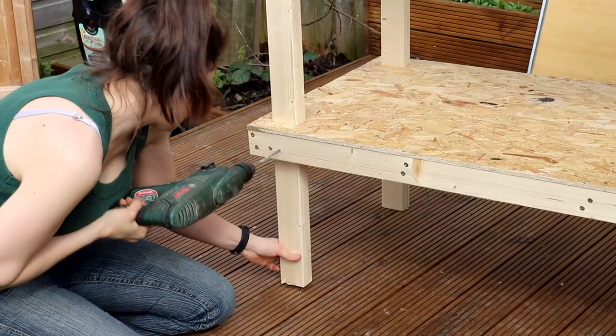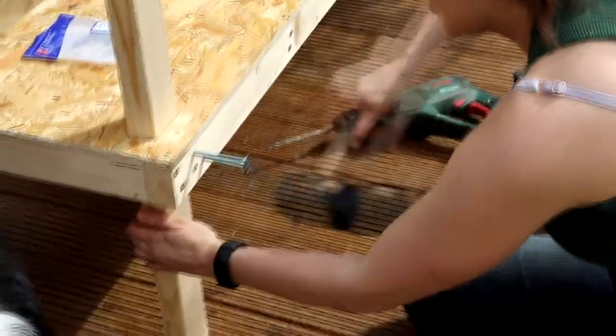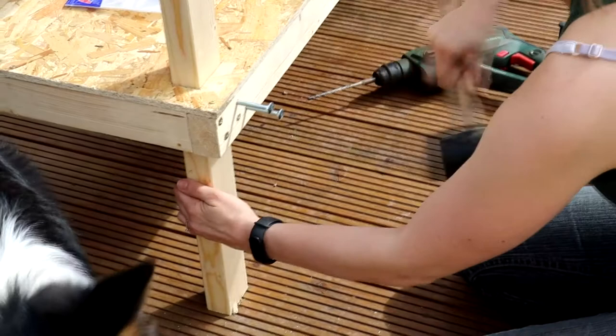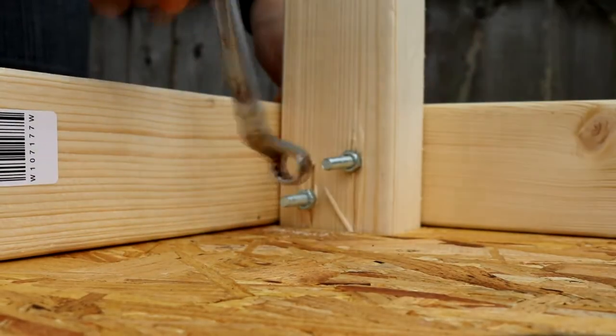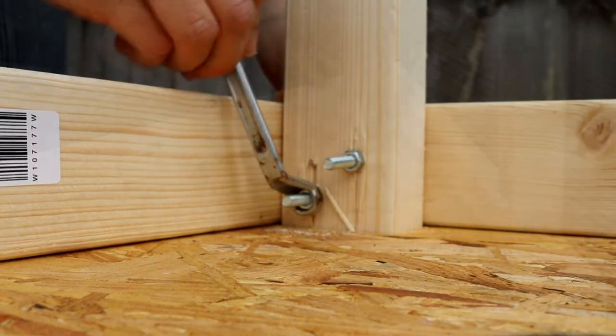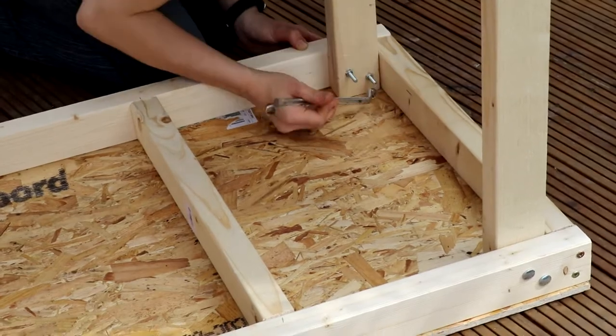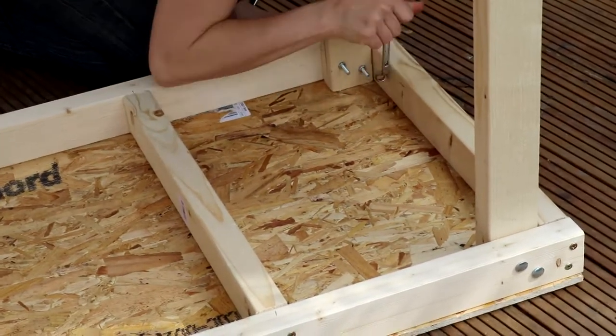This is the long drill bit I was telling you about. I knew I couldn't use a short drill for this, so I drilled straight through the two pieces and went all the way around, malleting in two carriage bolts per lower leg. Then the final bit was to tighten the nuts with a spanner, and that was it. I do regret not using washers as well, because sometimes the nuts partially went into the wood — but I really didn't think it was that big an issue. That's the only thing I'd do differently.